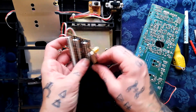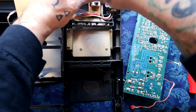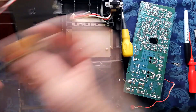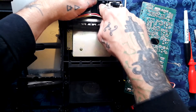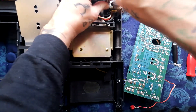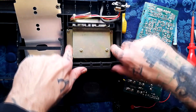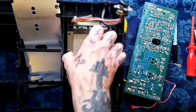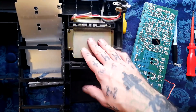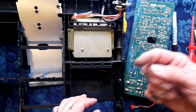These individual meters just clip out - yellow on the right, then black, then red, then white. Just for good measure, let's detach this Dolby switch completely. That cable has a retainer that looks like you need a specialist tool to undo, so that's going to need to sit there. This power socket seems to be held onto the chassis with two screws, so we could get to everything there if we needed to. You can also see it's going to be these four screws that are attaching the transformer to the plastic chassis - I'll leave that in situ. That's enough access to be able to do anything I needed to do, and I can get in here and get all of this old dirt and dust off.